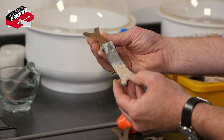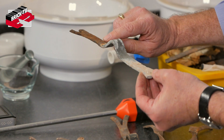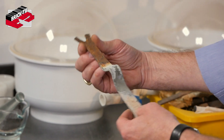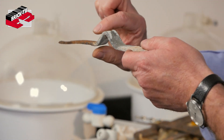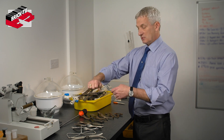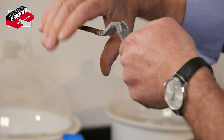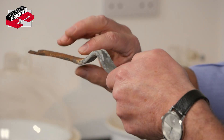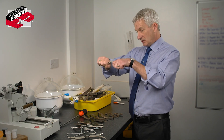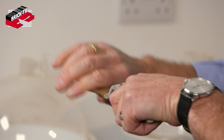Typically you'll get a tie that's still in reasonable condition with a bit of white oxide on the drip feature in the cavity, but the external face is now completely unprotected — it's actually thinner and has lost some section. When in the wall it will have had a big fat layer of lamination on it, and the house probably had horizontal cracking visible from the ground. You might say you can't bend it, it's rock hard, but the bond is now compromised. The wall is effectively built onto a dirty, rusting layer, and in high winds we see collapses where the outer leaf gets sucked off, leaving behind a structurally intact but exposed inner leaf.